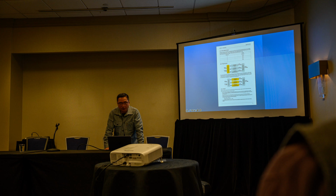So if we're right and everything we need to know is just in the frequency response, then you can take a headphone like a Sennheiser HD800 or HD800S, which always, unless something went wrong between when they shipped it out of the factory to when it comes to you, the customer, it's going to measure symmetrically. I know this because I've measured a zillion of them. Okay, not a zillion, nine of them. I measured HD800Ss. I even did a presentation in London where I showed what happens to the distortion spurs. So just like measurement microphones, the sensitivity is not always equal between two different pairs, but they do multi-parameter driver matching across a pool of thousands of drivers.